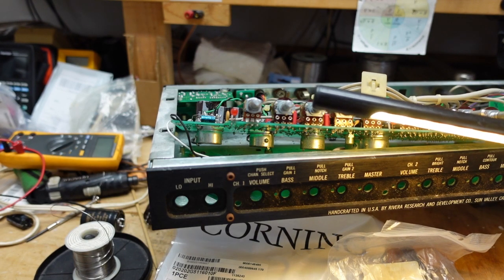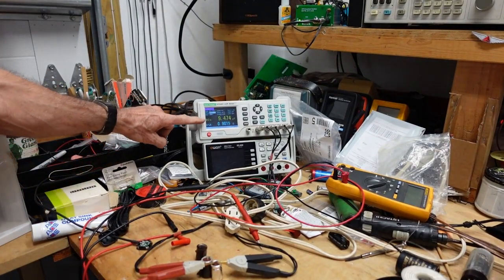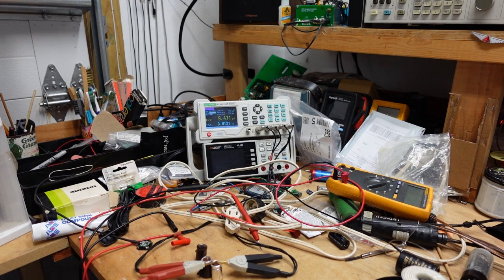That one checks pretty well though. If you look at that, you can see the meter. It's almost 10 microfarads and it's 0.9 ohms. That one's probably okay. It's not going back in. So anyhow, I'm going to go through, pull some of these others, place a parts order, and we will be back.